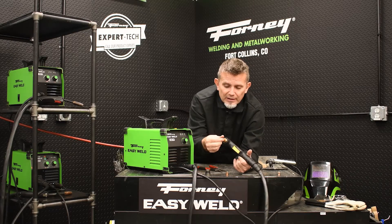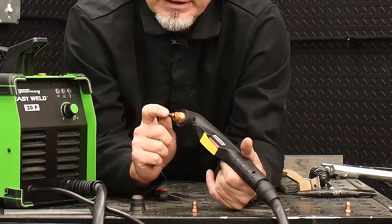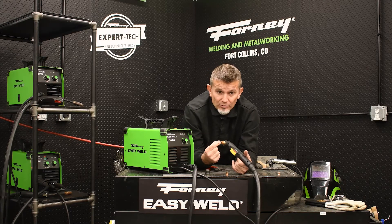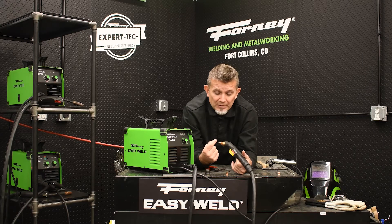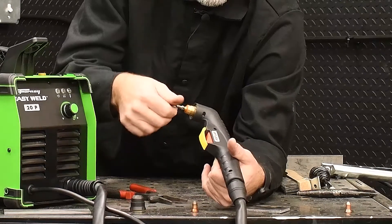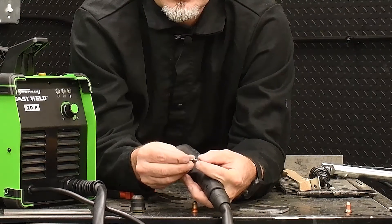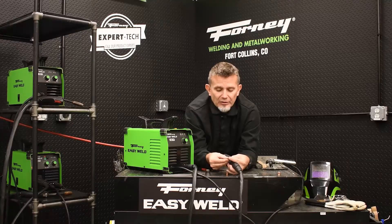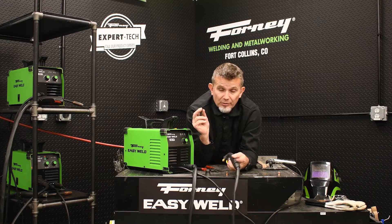The last piece that needs to come out is your electrode. A lot of times you'll find that this electrode has been loosened up after you've been using it, and a loose electrode creates lots of problems. What happens when you're creating a plasma cut is this torch head — particularly the electrode — gets super hot and then it cools. That hot-cold action actually causes this electrode to loosen up, and then you're going to get a terrible arc performance. So make sure that your electrode is nice and firm. You'll notice on this electrode there have been some heat marks — you can tell it's been well used, but it's actually still in reasonably good condition. If I look at the end of my electrode, the hafnium that's inserted in there is still in place, so I would go ahead and use this electrode for a little bit longer.